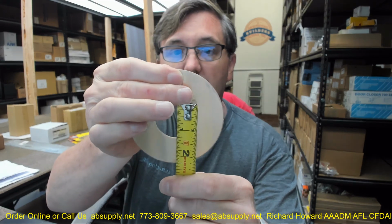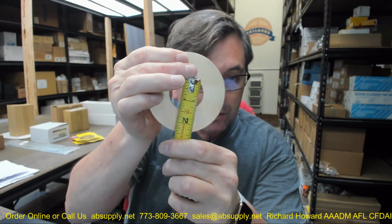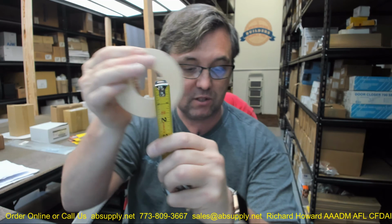And a 1.5-inch hole is going to work with just a small variety of locks. Schlage may still have a lock that'll go a 1.5 inch. I know that they do. Forgive me. I know that they have locks that'll go a 1.5 inch. Their B250 series will. They must have a modern version. Their B60 must go into it.